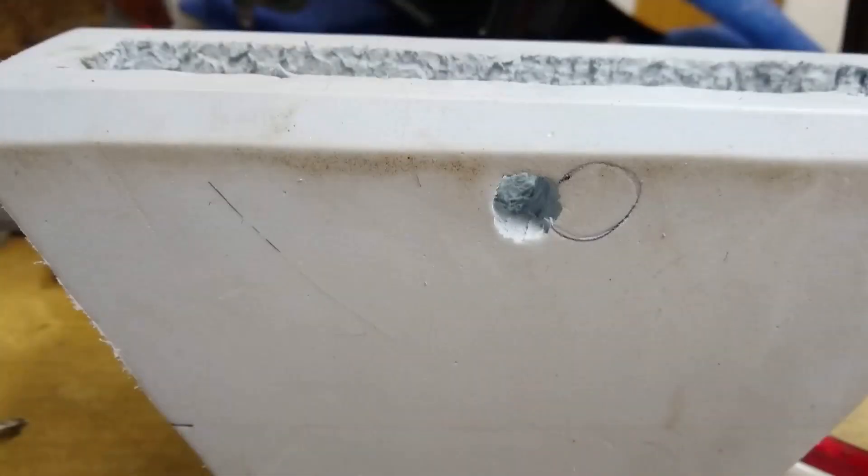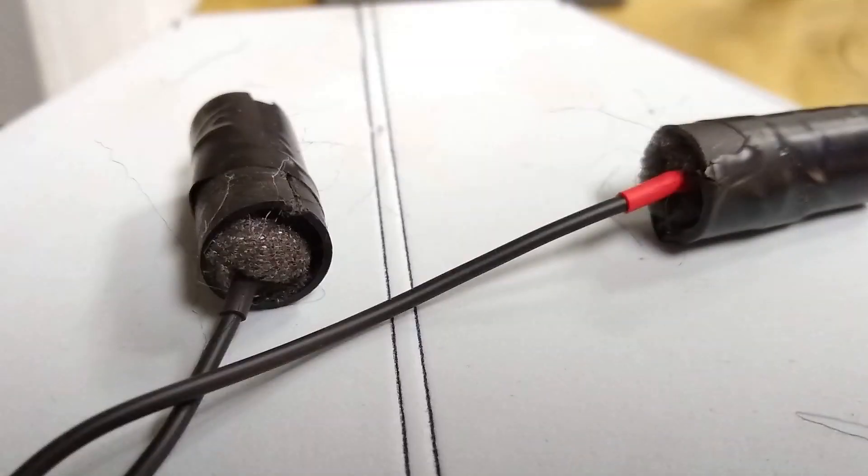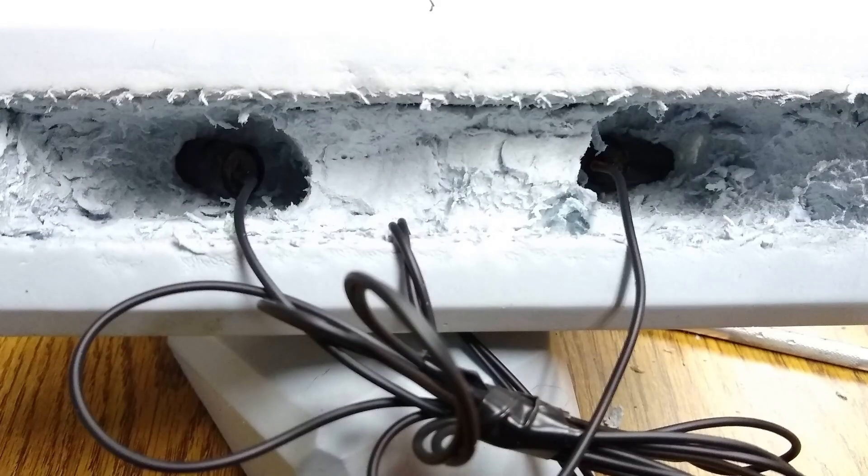On the bottom, I also made a hole with the 13/32nds bit so that I could run the plugs and wires out. Since I didn't order any mics with protective capsules, I quickly made my own using some marker caps. The ones I had laying around were around 12 millimeters in diameter, and again using the 13/32nds drill bit, I made an opening at the top. I also made a slit down the side of each marker cap that made it easier to position the mics flush with the top. Then I added some foam to the hollow cavity and taped them together. Adding the caps helped to have a more secure way to put the mics into the side holes.